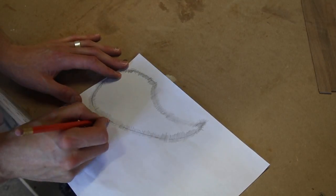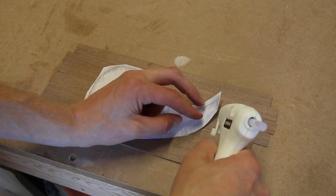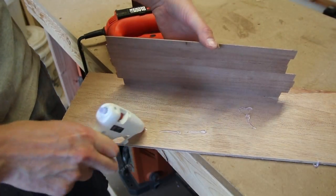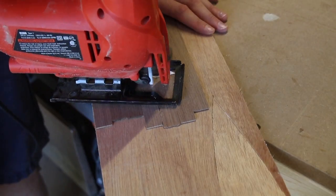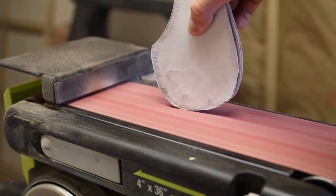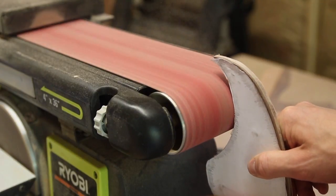Now that I had my thin piece of solid wood, I added the shape I traced earlier to cut it out. I'd advise using spray adhesive for this, but I used a hot glue gun — it did okay, but spray adhesive would have been better. I glued the paper onto the wood and then glued the plank onto a sacrificial piece of board so I could cut it without chipping. I used a jigsaw with a fine-tipped scroll saw blade to get in and out of the curves easily — I'll leave a link in the description for those blades. I left a little extra space when cutting so I could sand down to the line on the bench sander, which worked out really well.